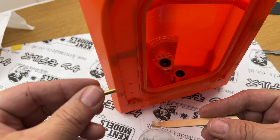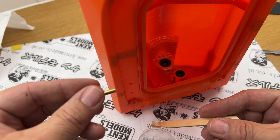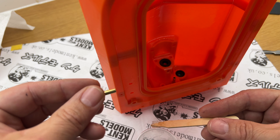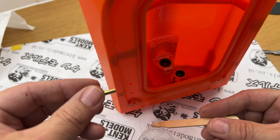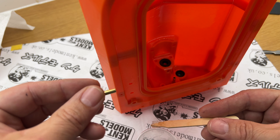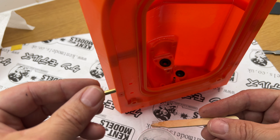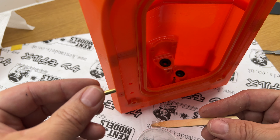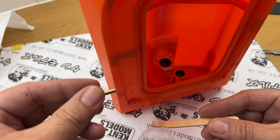We also use M5 grub screws - one in the end of the pump unit, one each side, to keep the cover attached. The 3D printed thread actually works fine. Push another ceramic bearing into place using something flat - don't push it too far or it'll push the bearing out. For the steering rod, push it on with the flat aligned as described in the instructions. Install the small pin into the steering piece using a vice to push it in straight.